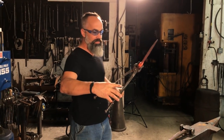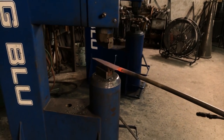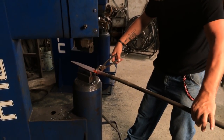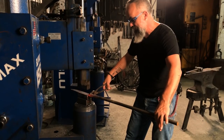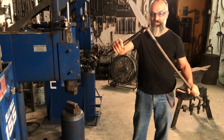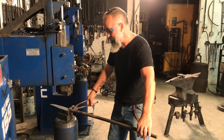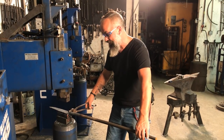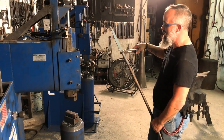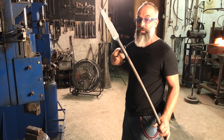When I want to control this piece now I have total control — I learned this from Jimmy Crowley. So I can get under here instead of working it where I have very limited control. Now I'm totally in control and I can do anything I want here, because I have control of two points of contact. I can stop. So I'm isolating where I'm going to forge. I'm not able to get any further in than this, so now I can pull the width out and it'll end up looking like a spear. You don't have to worry about if you have too much on one side or another because you're going to take it down to quarter or three-sixteenths, depending on how much heat you have.